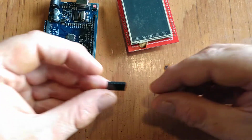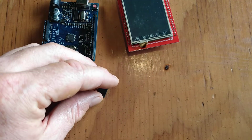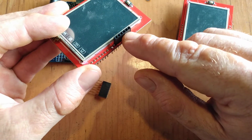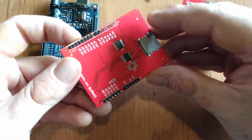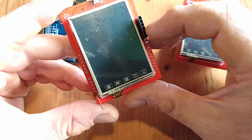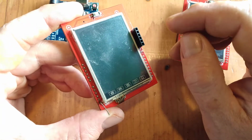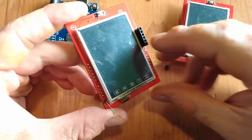So what I ended up doing was I grabbed one of these, pulled out the soldering tools, grabbed this little connector, and stuck it on there so that I could access pins 10 through 13 and that ground there, analog reference if needed, that's there as well. But it gives me access to a couple of pins, so SPI communication to run some sensors or some digital outputs, which probably need to go through some, I don't know, 74HC595s or 74HC165s, some shift register, in and out shift registers to get plenty of pins there.